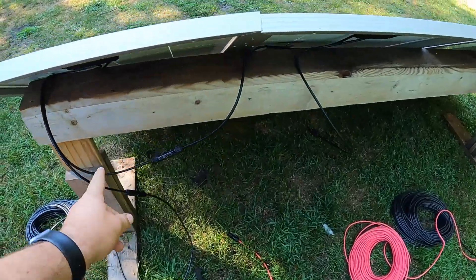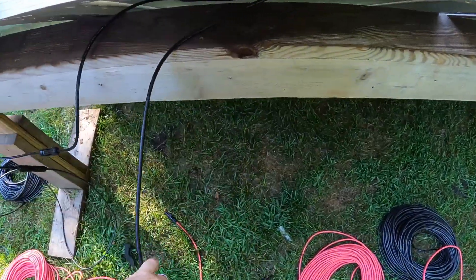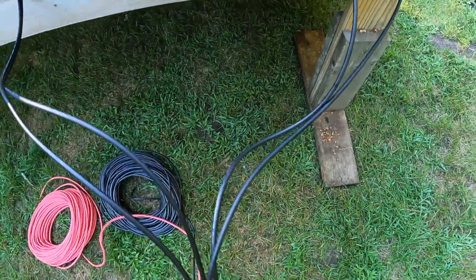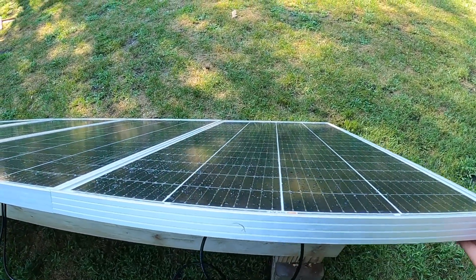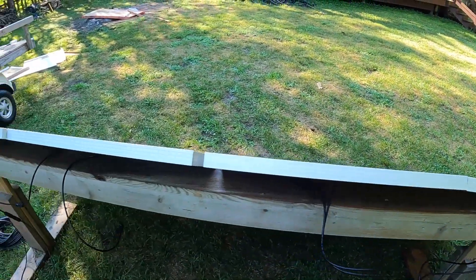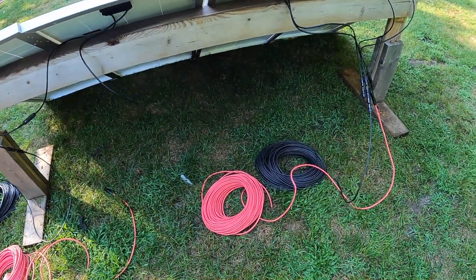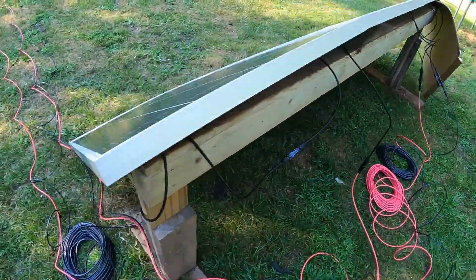These two panels are in series. Here's where the series connection is — I'm leaving this disconnected because I'm not running PV breakers, so this will be my disconnect for the experiment. Here is the parallel side, and I'll be raising that up a little bit to make sure neither panel is tilted differently. They're all pretty much the same. Going to connect these up to the charge controllers and make the final connections. Series is now live as well.